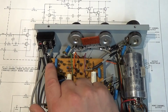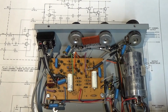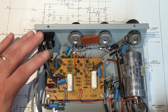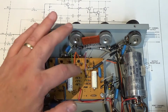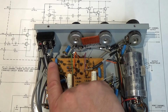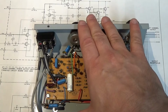It does look like this first transistor, which is the one where it comes in at. From looking at it on the scope, I'm thinking that these transistors are a little bit noisy, which doesn't surprise me. They're all the same. They're all NPNs basic. I think they're similar to a 2N2222, all of them. But the signal will go in clean and it'll come out really highly amplified. This amp is super, super high gain.